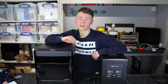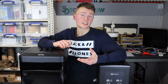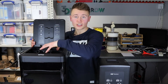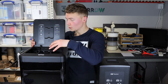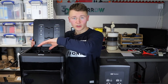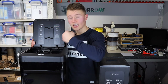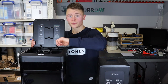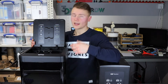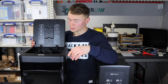Now let's go on to the cons. The first thing I noticed that could stand to be improved slightly is the layout of the Bowden tubes. Because you're dealing with quite a small printer, at times when the head is moving around the Bowden tubes can be at quite a tight angle — meaning when you're loading material in through the Bowden tubes initially you do have to push quite hard. It's not the end of the world, but it was something I noticed.